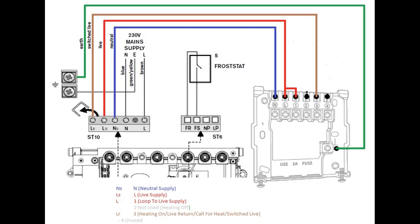If you took my advice earlier and jumped directly to this bit, welcome back. The earth — we don't actually need it to work the Hive. It has an earthing point should you want to use it, but it's double insulated and the manufacturers say you don't need to. The diagram on the left shows where all the cables go — the brown and red wires are on this diagram and you can see clearly how they all link up with the Hive back plate.